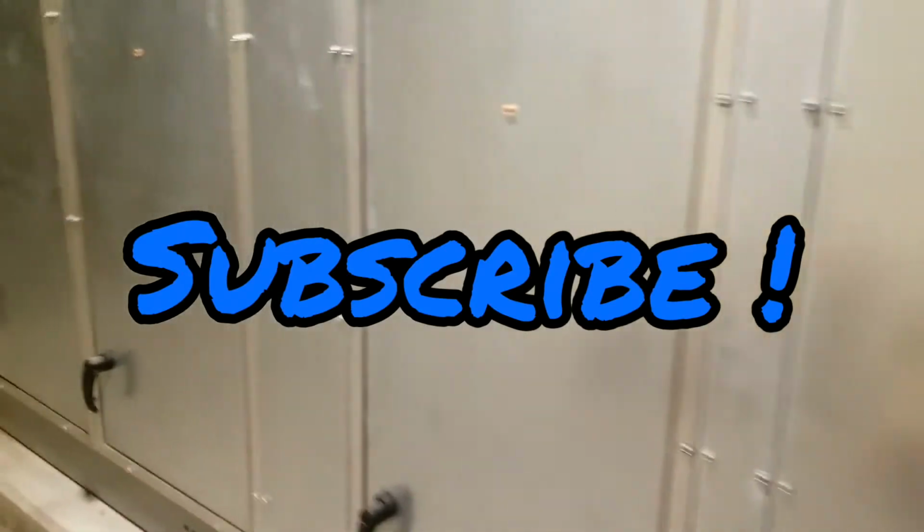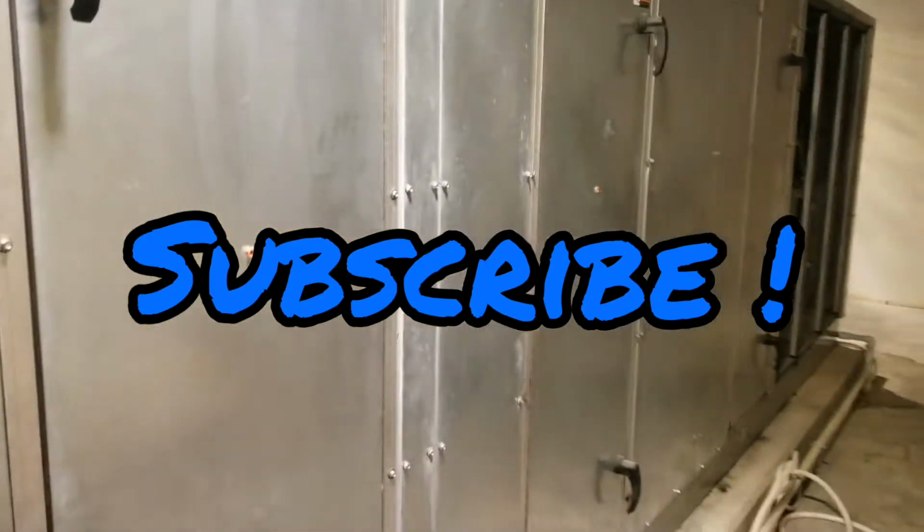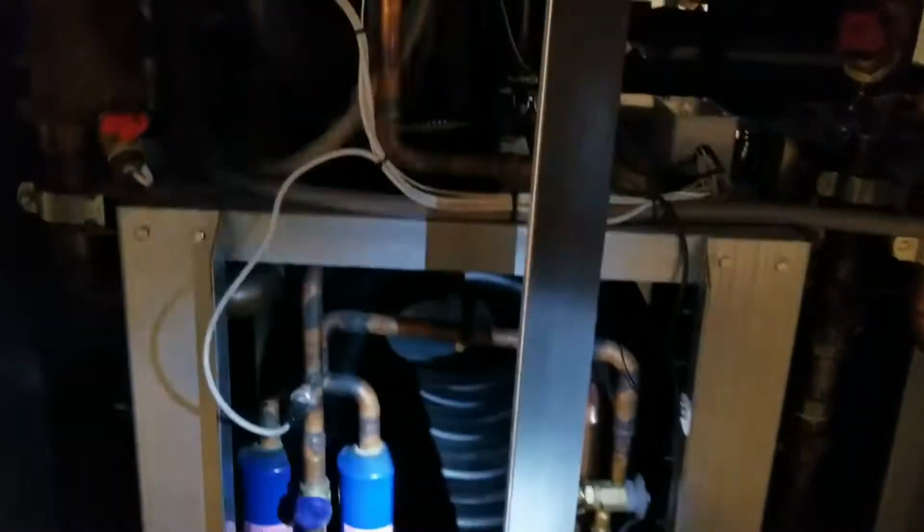Alright guys, so I'll show you a little bit of what I got going on here. We have kind of an unusual setup, but I already changed the filters and rinsed the evaporator coil. Actually, that's not the evaporator coil, that's a separate water coil that's not connected. This is the actual DX evaporator. That's for water. This is a water source heat pump. We have 4 stages. I'm guessing about 20 ton, 25 ton apiece. There's our coaxial coils, our expansion valves.